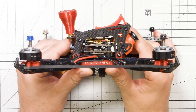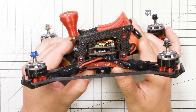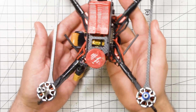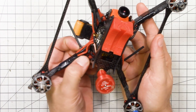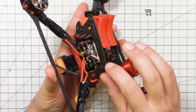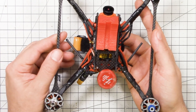For a really tight build like this, I want to let you get a look at how I put it together, because every decision might seem trivial individually but could be interesting to others who haven't thought of them. One thing I've done is put the antennas on the arms, as I do on most of my builds. I don't like having antennas sticking up above because they tend to get knocked off and broken — even zip ties get broken. Having the antennas on the arms does hurt range, but for racing I've never had it be an issue. I don't even get low RSSI warnings.